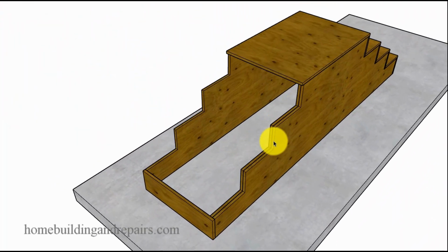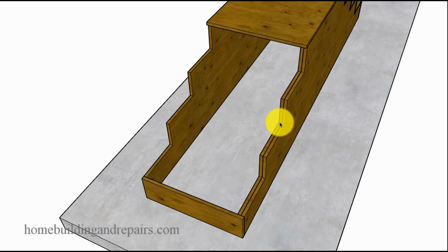So I also wouldn't suggest doing something like this where, again, these vertical surfaces, if you have water that's seeping into this gap, and it's working its way through here, or it gets trapped in here somehow. Maybe it gets trapped because you put a layer of adhesive down here in a couple of rows, hoping that you would stop it from coming down, and now it's being trapped in there. It's coming through the first line of resistance, and the second line, of course, is working and trapping the moisture, making the problem even worse.